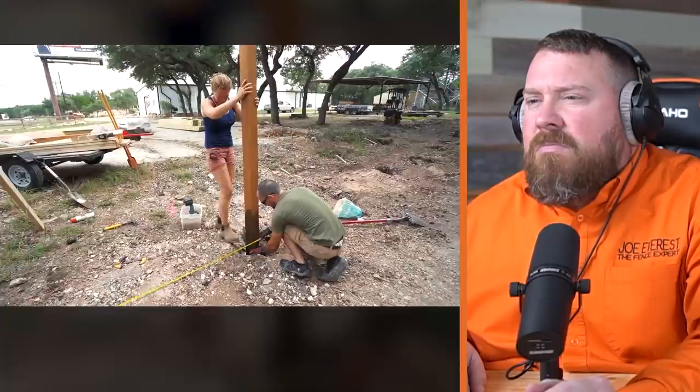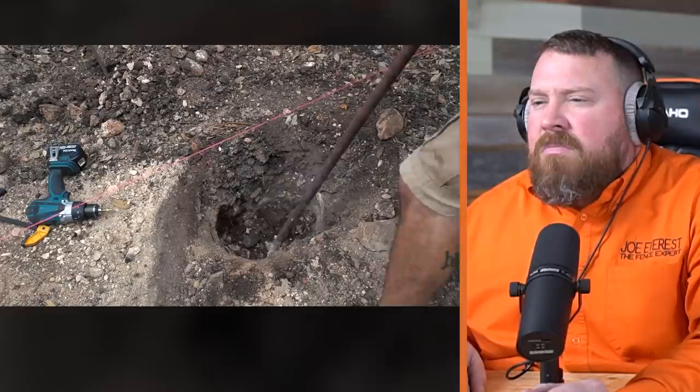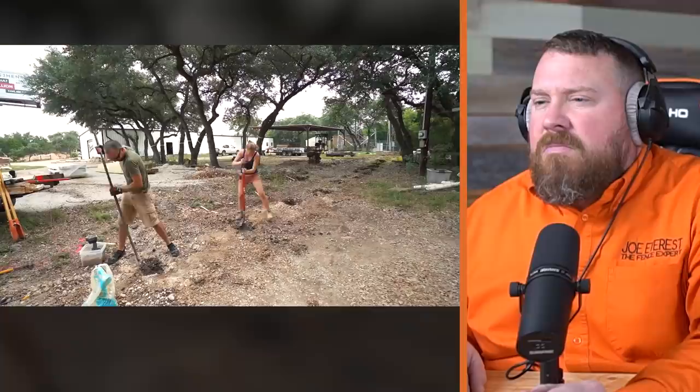But with a horizontal fence, the length of picket determines where the posts are. We pulled a tape on each and every hole before setting the post to make sure it was drilled in the correct location, and plenty of them weren't, so be sure to check. We had to chisel out so many of these holes with a rock bar and shovel to get the post to not only land on the needed distance between, but also the 1 inch off the string line.